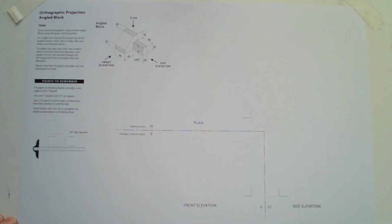Mine is already. The second thing you do when you do instrumental drawing is put your name in the title block in beautiful capital graphics letters. Make sure each letter is touching the top line. Make sure each letter is touching the bottom line, so they are all of equal X height. Make sure that it's your name and not somebody else's name.